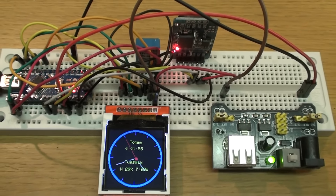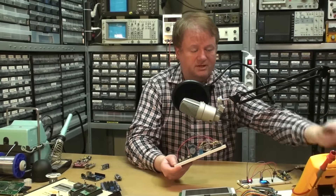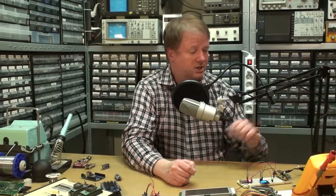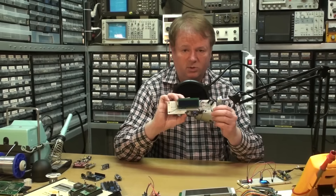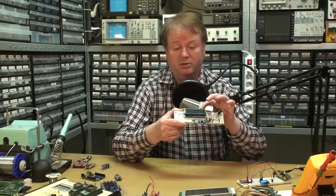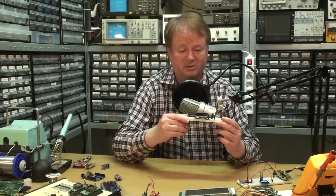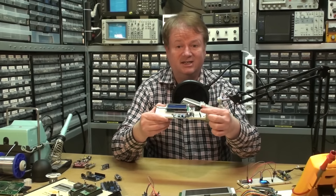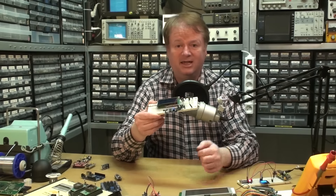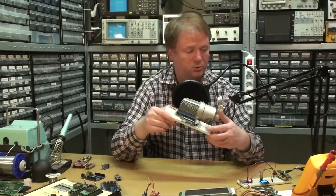There's a little color screen, as you can see. These are really cheap — the color screens cost about $2.50, almost half the price of an OLED display. You could also use traditional displays. I've used one here together with an I2C converter to a 16-pin breakout, so you can use a traditional Hitachi HD44780-series display on a small unit like the DigiSpark. The DigiSpark is also a small ATtiny85 which you can run Arduino on. It doesn't have many I/O ports, so you could use one of those converters to get more I/O ports.